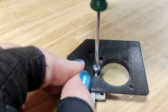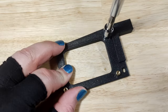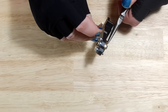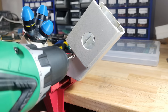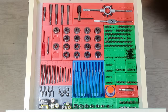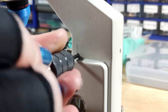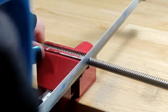At this point, I made some more pre-assembly preparations: I joined some parts, filed away some excessive metal on the microscope body, drilled and tapped some holes into the microscope body to hold on to some structural pieces, and also had to cut the lead screw I had to size.